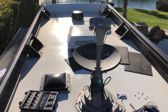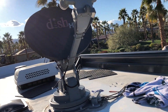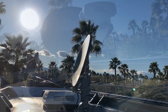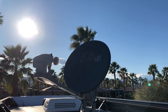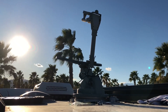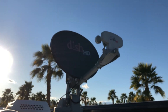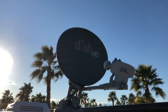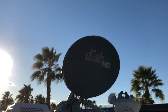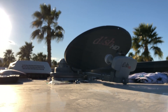I went back down to the interface box and started testing. The unit certainly went through all of its activities — the searching — and it found a bunch of satellites. Unfortunately, because we're in California, it doesn't find the default satellite, so I have to manually tune it to 61.5. But really for me it was just making sure that the dish was functional again. And it is. This is where it stows itself. Everything was working fine — a successful install. Took us about two hours to get this task done.